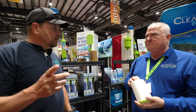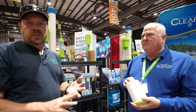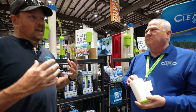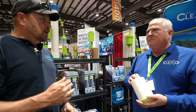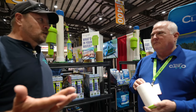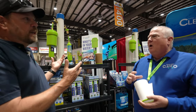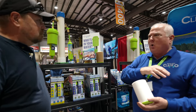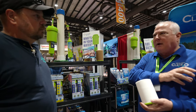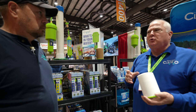We did a video when we last got together where we compared flow to the blue filter — there was a little less flow but it really wasn't that bad. From my perspective I haven't been bothered by it, because a lot of times when we camp it's nice to have a little less water flow since we don't have a big tank. But I can understand that if you're on full hookups you'd want more flow. A lot of people also have on-board filters, so they can use a high-flow filter on the outside and a lower micron filter on the inside — giving you the ability to pick and choose what fits best.